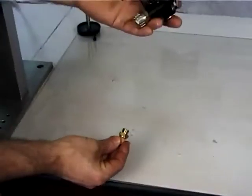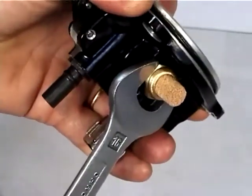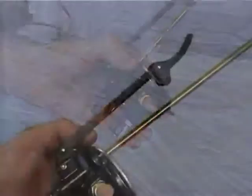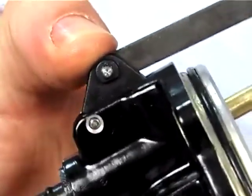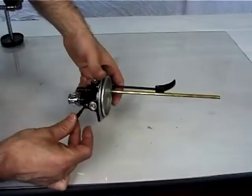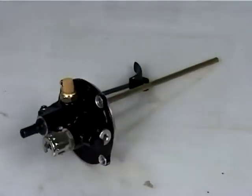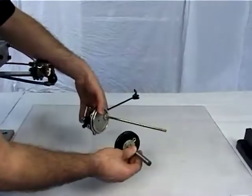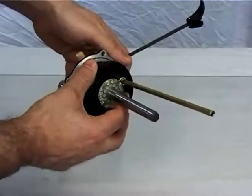Check for the good condition of the silencer, figure 53, prior to mounting it, then block it by means of a 16 mm wrench. Check that the connecting rod, figure 8, is not bent and the fork, figure 10, operates correctly. Screw the suction adjustment knob into its seat. Insert the pneumatic cylinder after assembling it in order to complete the mounting of the bottom.